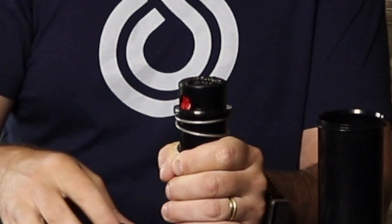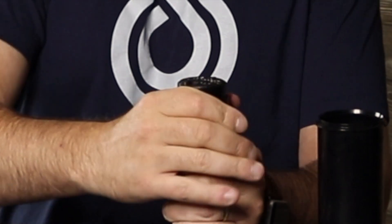This ring that sits underneath can be reused, so you'll take this plastic piece out of your existing sprinkler and put it back on when you change out to the new rubber seal. You can pull the top off, put the new seal onto the sprinkler, put the top of the canister back on, and that is all there is to replacing the riser seal. Sometimes riser seals wear out if there's a lot of dirt and grit, or if your sprinklers are installed in sandy soil — things like that cause them to wear out, but you can easily replace the riser seals.